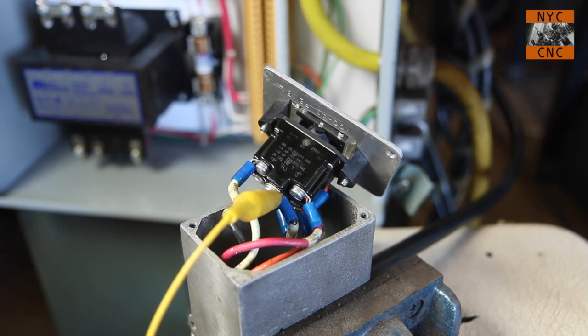So let's just put it on a different, oh, I meant to mention too, a great reason why you need to be really comfortable that you've got the skill sets to do this and that you need to get outside help like an electrician is capacitors. This machine doesn't seem to have any, and I think all else equal, you don't have a big motor starting capacitor on a three-phase motor generally. I'm not an expert, but that's a great example of where you may have a piece of equipment that's unplugged, but that capacitor still has storage in it, and you could very likely discharge that cap if you start shorting things together experimenting. So again, I'm trying to balance that line of have fun and enjoy stuff and try to hack it and figure stuff out.